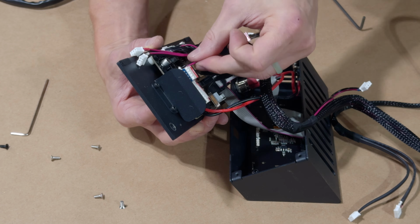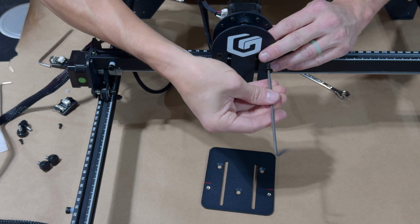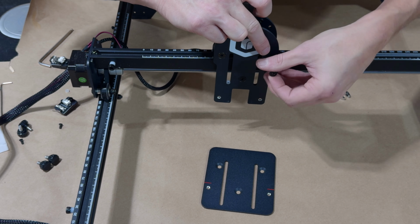So the next part here is you have to actually put this front plate on that they supply you, and the way you have to do that is you take the 3 screws out for this big metal mounting plate, and that is actually running through the top and lower guide bearings. So you have to pull all those apart. You can do it one of 2 ways. You can take the whole unit off, take it apart, or do this while it's on the machine.